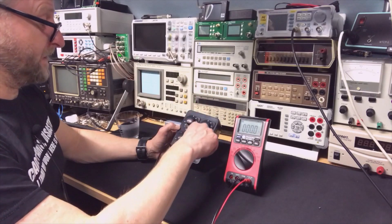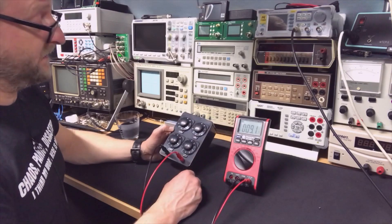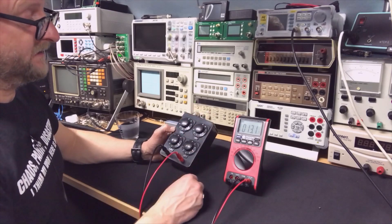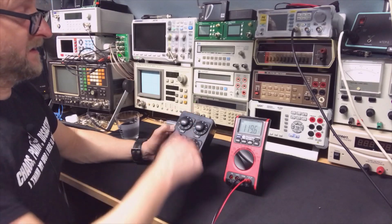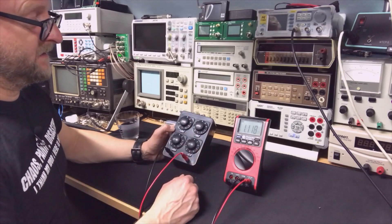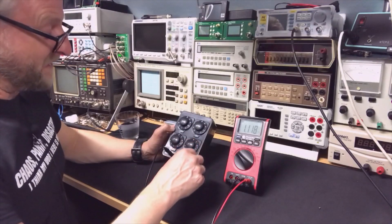We knew from other tests that the ohms range was also not that precise, but it says zero ohms on a short. This should be 9 ohms — it is 9. Then we had 10, so we should have 19 — and we got 19. Then we add another one, should be 119 — and we hit it. The ohms also became a lot better. Happily surprised.